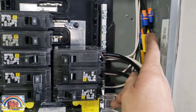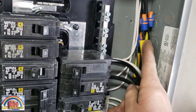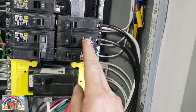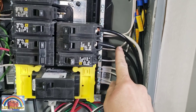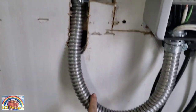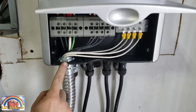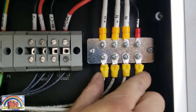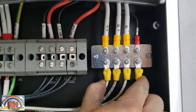As far as the electrical requirements for the system itself: six-gauge wire for the power supply, and all your branch circuits need to be in 12-gauge wire. The supplies we provided were the breaker for the feeder for your panel — for us it turned out to be a flexible metal conduit over to the panel itself — and then we just needed some crimp rings to get onto the neutral bus. That's all the electrical components.